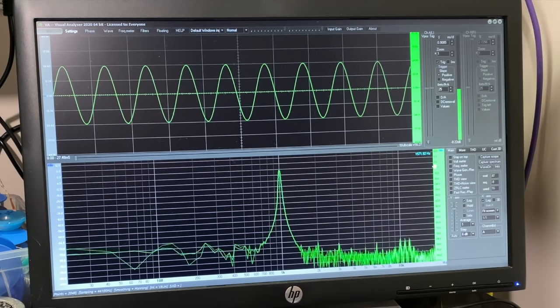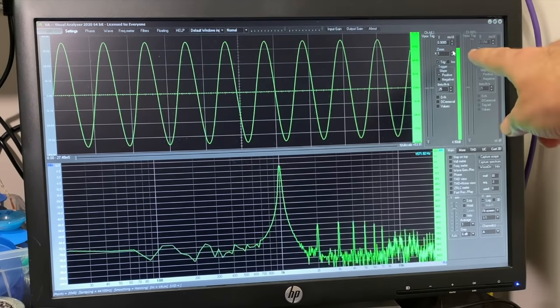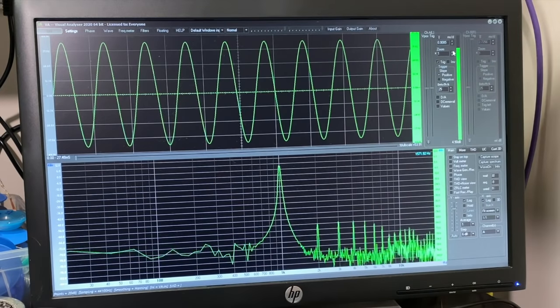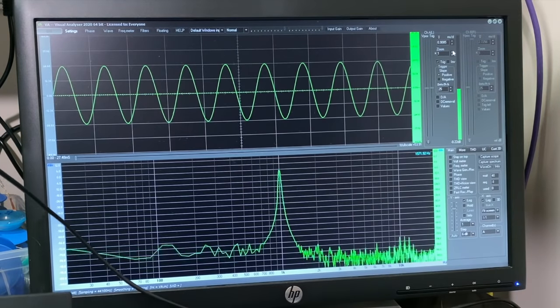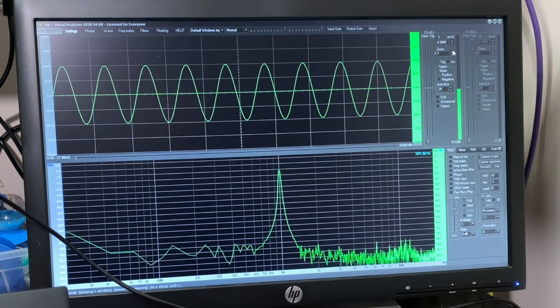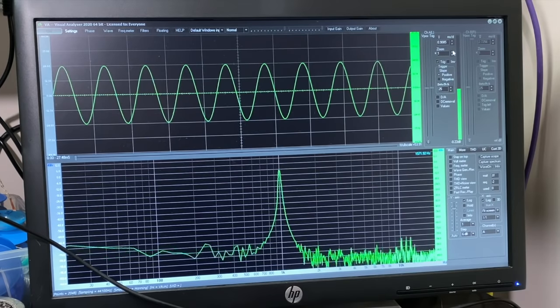It's zeroed at 0 dB. I can see it's about halfway — it says minus 0.22 dB. We've got very little distortion here. This is probably some noise going on inside the computer itself. If this is 0 dB, then the noise floor down here is at minus 78 to minus 80 dB, which is pretty good. Now if I increase the amplitude of the input signal too much, you start seeing distortion — we're getting into distortion territory inside the sound card. So rule of thumb: play with the attenuation, either the times 1 or times 10, to ensure that level never goes above halfway.